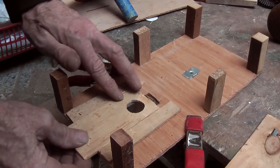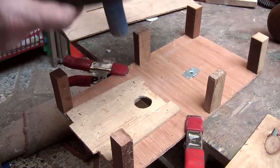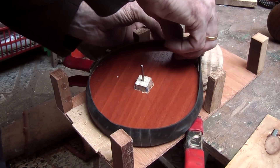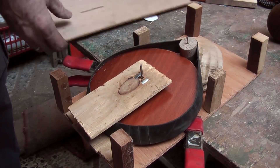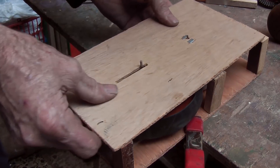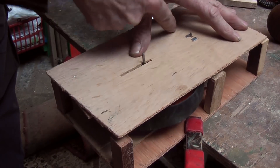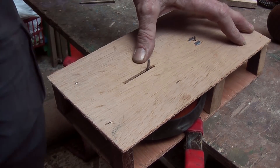Right, so we are going to assemble it so we can adjust the belt strength. Put it together like that — that through the hole, the other one into its bearing, that one there on top, then the lid with the bearing into the other. Then we are going to screw it down with six screws to put the lid on, so we can adjust that belt tension.